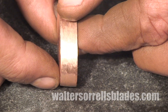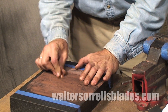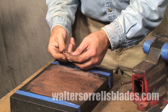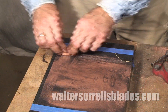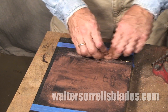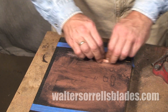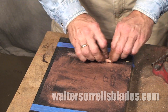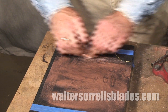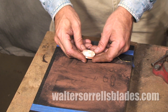When you use sandpaper, work it in one direction, creating scratches that all run parallel to each other. Then, when you switch to a higher grit, change to a new angle. This process exposes the previous scratches — and this is really important. If you change grits and keep scrubbing in the same direction, you'll frequently hide big scratches from the previous grit size, and you won't find out how bad you goofed up until you've done a lot more work.